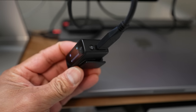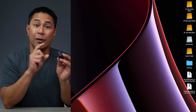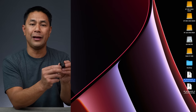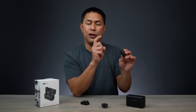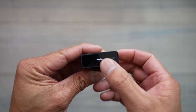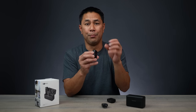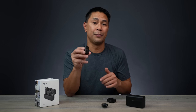For the receiver, it's the same process — power it on, plug in USB to your computer, grab the receiver bin file from your downloads, and drag it over to the receiver mounted on your desktop. That will put it into the root folder. Once that's done, eject it, and you should see 'updating' on the very top of your receiver. Once updating is complete, power it down and restart it. You'll see a blinking red for a bit, then it'll turn green, which means the firmware has been updated.